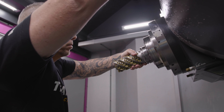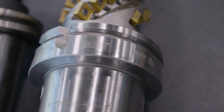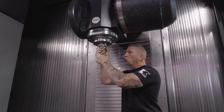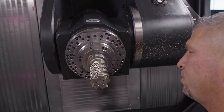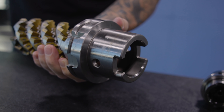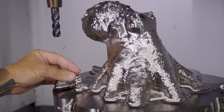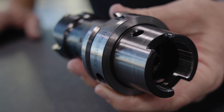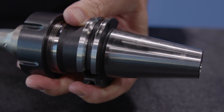HSK 100 tool connection is great for this machine because we've got big torque and big power. The HSK 100 is the name for the spindle connection — where the tool fits into the spindle and gets grabbed. An HSK 100 is nice and rigid. You also have an HSK 125, which is a step up. The HSK 63 — which you'd see on the 500-pound titanium octopus videos — is smaller, close to a CAT 40. The HSK 100 is similar to a CAT 50.